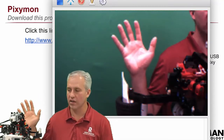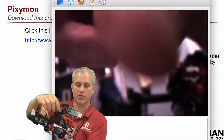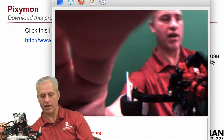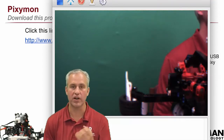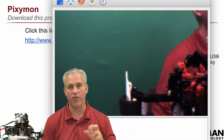You can actually see my green screen in the video feed. The camera has a focus ring — I'm twisting the lens to adjust it. If I want to focus on my face I can do that. So it gives you the camera feed that it sees, but the information it actually passes to the brick is different. It passes just x, y, width, and height. It does that to take the heavy processing off the LEGO and handles it on-board that little black board.